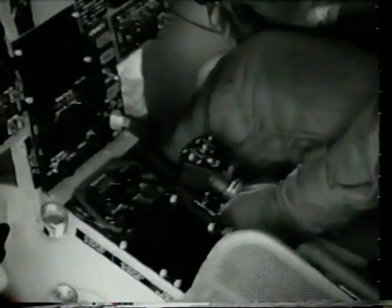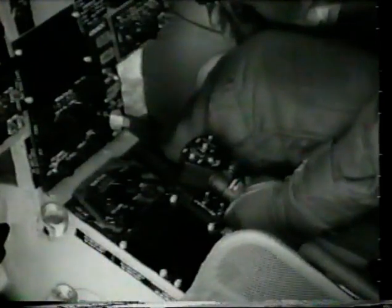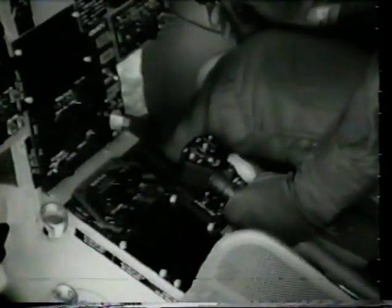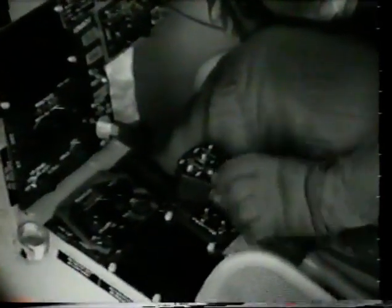Caution, if battery and fuel boost pump switches are on and throttle is open before motoring engine, fuel will flow into the combustion chamber and can contribute to a turbine outlet over temperature start. Check the throttle for proper operation by rotating the throttle to the full increase position, then roll back to idle stop. Press idle release button and roll throttle to the full off position.